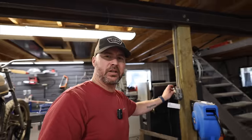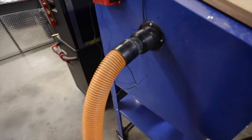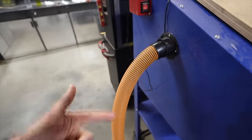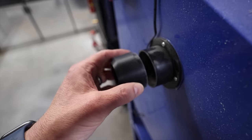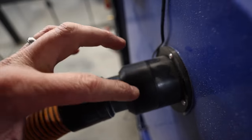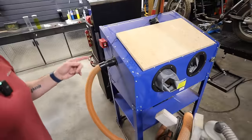If you can't find something on Printables or Thingiverse you can start designing your own, and this has been surprisingly easy. I've been shocked at how quickly I've been able to pick up digital design — I thought I was so far left behind that I could never come back. Start out with something small and easy. This is my sandblast cabinet from Princess Auto. What I would previously do is just set the hose of my vacuum in there — it worked okay but I always had a little coming out and ending up on the floor. Took a couple quick measurements, about a half-hour print, and now I've got a nice tight connection. Since there are about 7,482 different combinations to get hose adapters, it's actually quicker to build your own than to find one in a store.